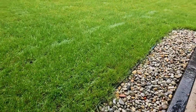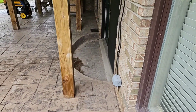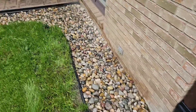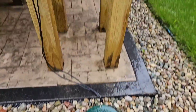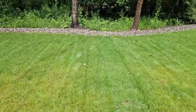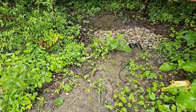There is a drain right here. When the cement guys did the work they went ahead and put a drain in there — but it wasn't really needed. You can see there really isn't any water to speak of finding its way down there. We have the downspout and the downspout line runs out to the woods — that's why there's two pipes out there. We have an outdoor sump pump system; we did not do the electrical here, the homeowner did that himself. The water just laid trapped in this flat yard, it went nowhere, so we built an outdoor sump pump system to collect all that water and dry it out.